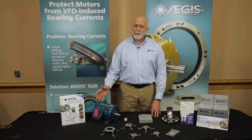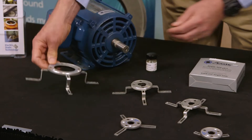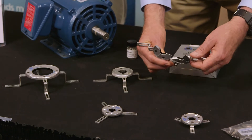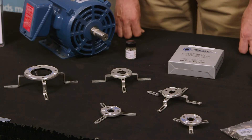The different products that we use: we have rings designed for small motors — these U-kits — all the way to the largest NEMA frame motors. They come with various bracket configurations, various heights, and even split versions for every motor frame size. These split versions are used to install on motors that are already coupled to pumps or air handlers.